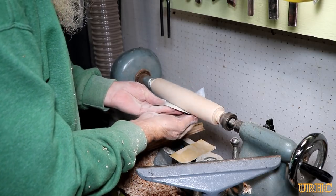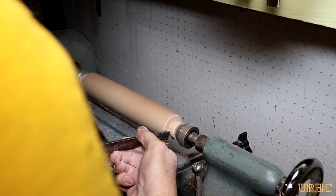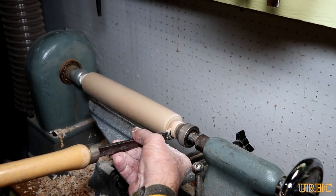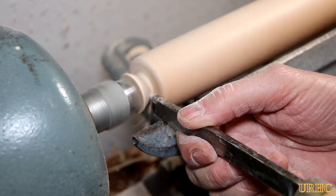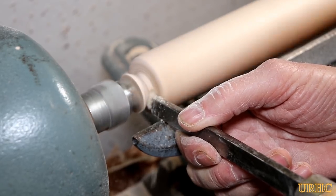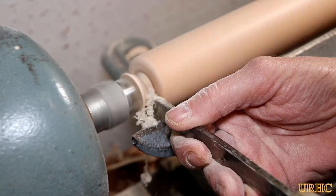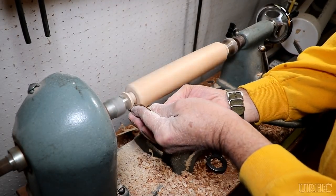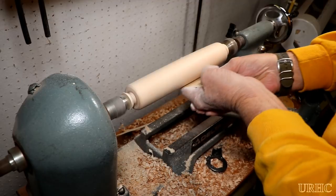I think this is down to about 220 grit right now. You can kind of see the dust coming off there — that's why I really have to spend some time coming up with a good dust hood for the lathe. I got it sanded down to 320 and then I'm going to go back and do a little bit more clean up on the ends. I'm going to undercut this here to approximately a half inch diameter left. You have to be real careful that you don't hit that drive spur, and you have to be careful you don't go down too far and have those ends actually break off with the piece flying across the shop. Then I'm getting up to 600 grit now — this is when you really start to see items polish up pretty nice in the lathe.